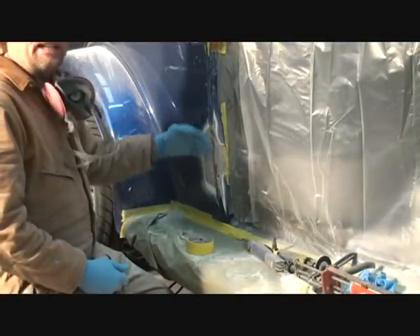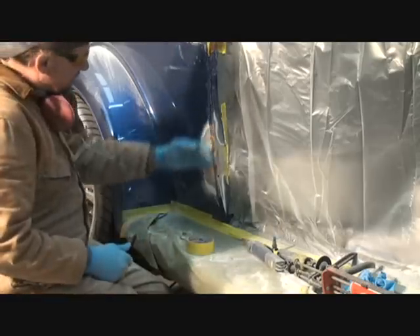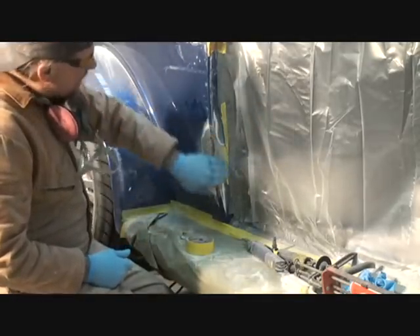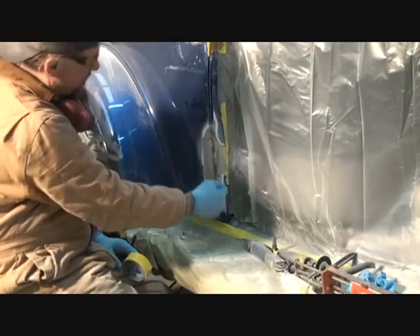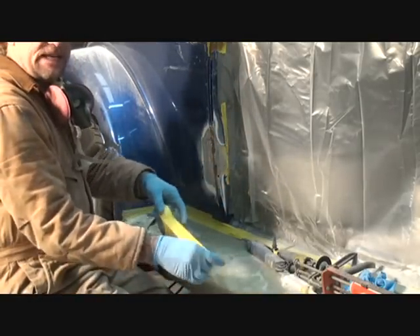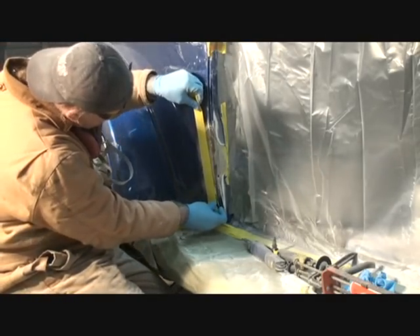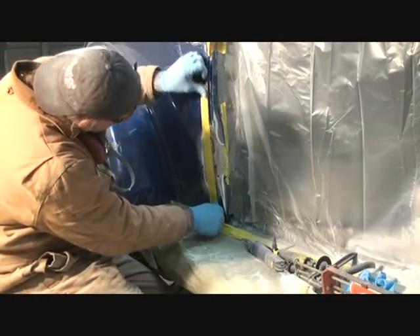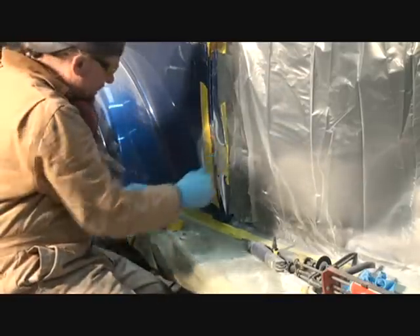What I did is I went ahead and sanded that down, and now this is basically roughed in — that's a roughed-in surface. What I need to do now is get that door jamb opening cut. What I do is I take a piece of tape to use it for a guideline, come right down here just like this, and that's going to show us the outside of that.